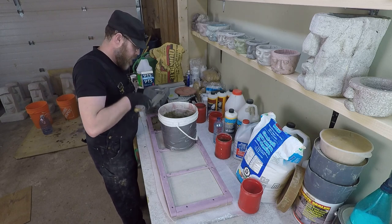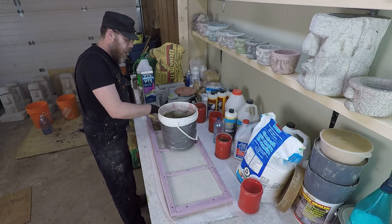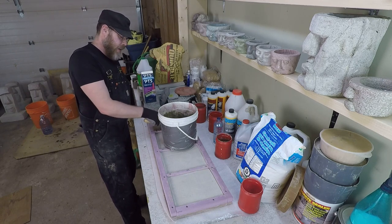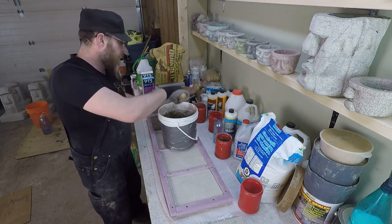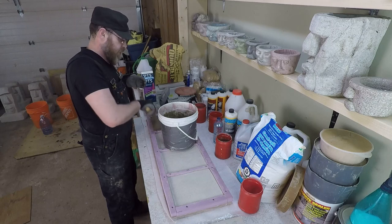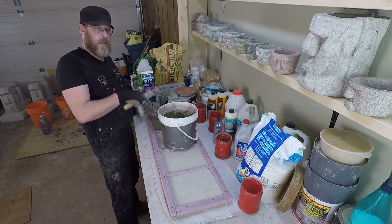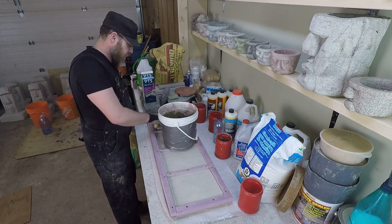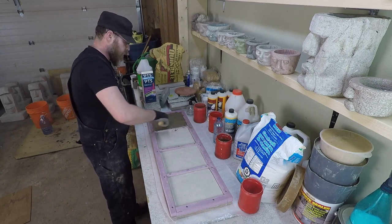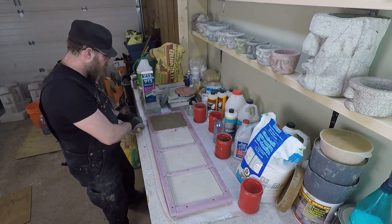I have a YouTube video with close to a million views, and one of the major things I don't think I made clear in that video — which I feel bad about — is this: when you apply a bonding slurry, unless the product expressly says otherwise, the new concrete has to go on before that slurry dries. You do not want it to dry or skin over. So the idea here is I've got a 3-to-1 topping mix going onto a latex acrylic bonding slurry that I mixed with Portland cement, and we're going to see how well it bonds to the old concrete.